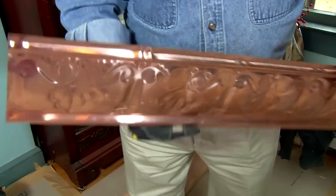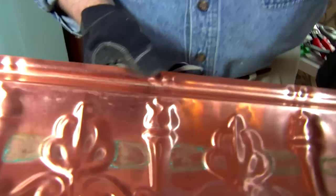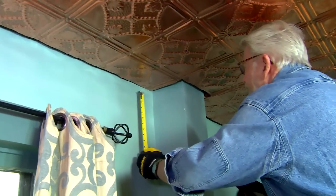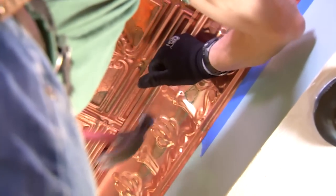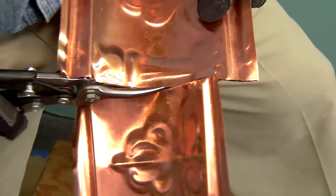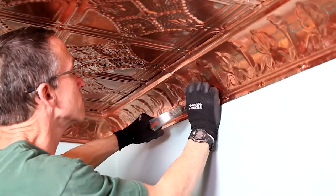This is the cornice molding we'll be using around the perimeter of the ceiling. The cornice will add an impressive decorative touch to the room and conceal any gaps around the edge of the ceiling. It's designed to be installed on a diagonal between the ceiling and wall, with the bottom edge of the cornice four and a half inches from the ceiling. We measure down that distance and mark the location with masking tape. The cornice sections overlap each other and are nailed into the perimeter furring strip on the ceiling and studs on the wall. Sections can be easily cut to length with aviation snips. Be sure to orient the overlap away from doors and entryways so it's less visible. It's generally best to deal with the corners first, then the straight runs.